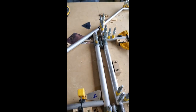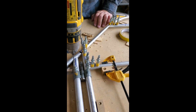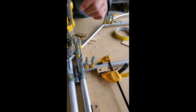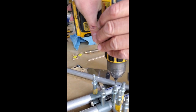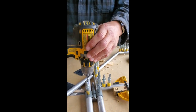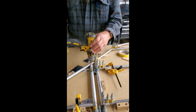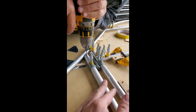We've got a theory we work with when drilling. If you're looking at the drill and it's perfectly square, and then you look at the drill from a 90-degree angle over here and it's perfectly square, then the drill must be perfectly square. It's not quite square right now. We're going to have Steve square it up and then drill that hole all the way through.